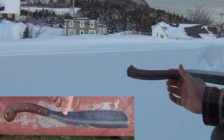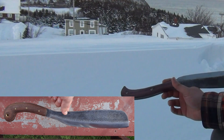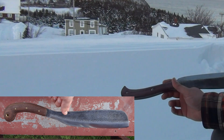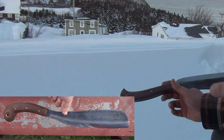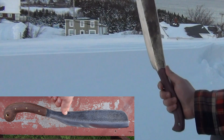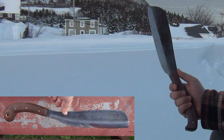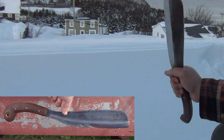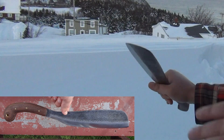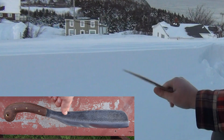After the handle exploded, I took some time to do a few modifications. This isn't modified to the state where I would say it's representative of an actual village parang, but it's closer towards it. I'm not confident enough in the steel to do the amount of work required to bring it there. The handle was brought up enough and fully rounded so it can do an overhand grip with the thumb, and this makes it almost neutral. You don't want it fully neutral because then it'll be relatively weak in a chopping grip, but it neutralizes the balance heavily.